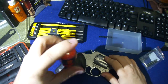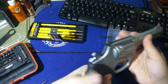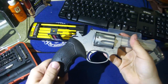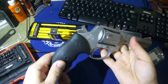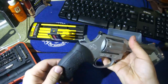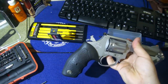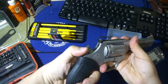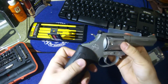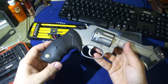So far, so good — everything just finger tight. You don't want to strip those screws. Gun looks good, let's check the functionality. Locks back in place — wow, that's a lot softer. That is a lot softer. Before I give it back to her, I'm going to take it out to the range and give it a test run to make sure there's no failure to fires. I tried it with a nine-pound spring and it didn't work. Had to wait for Taurus to send out some 11-pound springs. If it doesn't work, what I'll do is go inside and polish up some of the parts to make sure we have proper movement. That works too — fantastic. Single and double action — I think this is good to go.